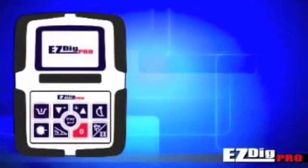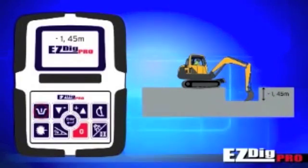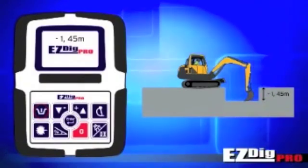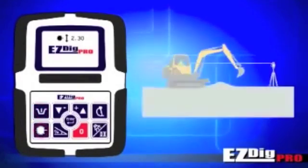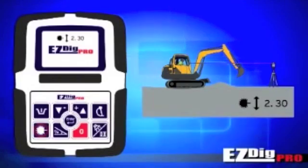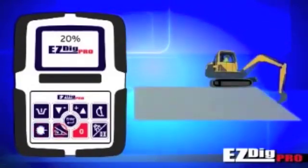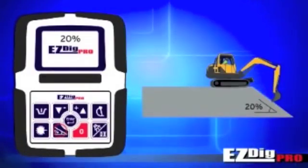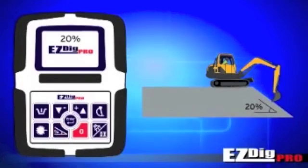The control box functions are easy to understand. Press the elevation button to set your desired digging depth. Press the laser button to use a rotational laser as your constant reference on the site — for example, after you have moved to the next position. Press the slope button to set your desired slope. The system is able to store five different machines with eight buckets each. To choose or calibrate a new bucket, press the bucket button.